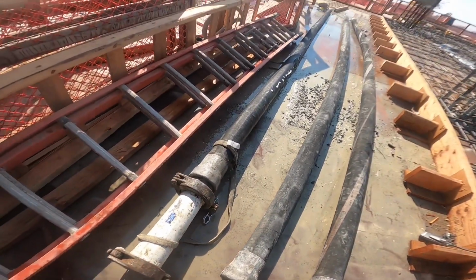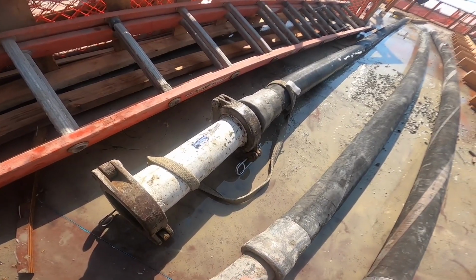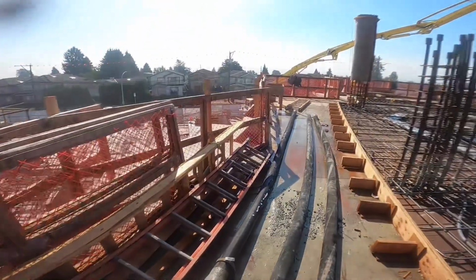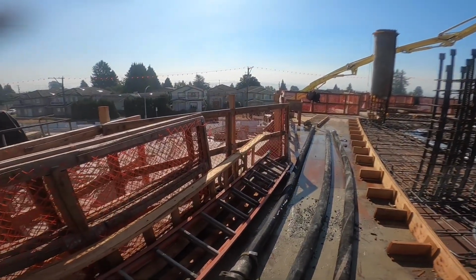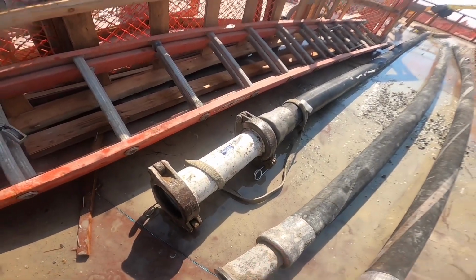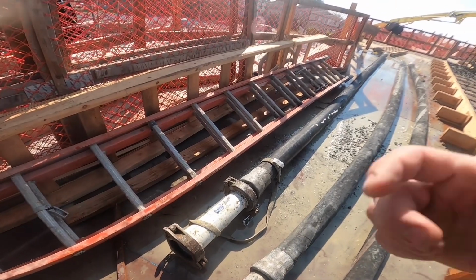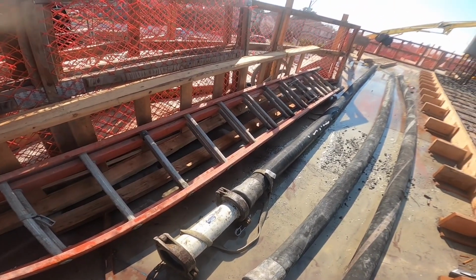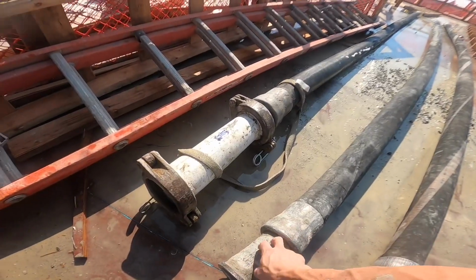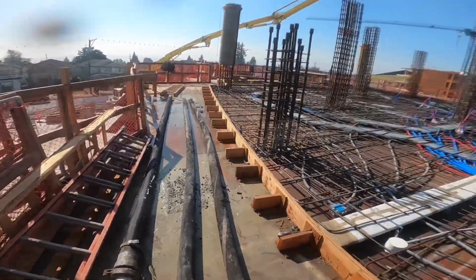The other crappy thing is if it plugs here and somebody smacks this with a hammer and puts a dent in it, this metal end doesn't last nearly as long. So we do have 5-inch to 4.5-inch reducing hoses where they reduce the stem. Not nearly concerned with those ones. It's a longer reduction and it's not nearly as drastic. Also, if it's the Alliance green line, I think the Conform hoses now too, they use a hardened end. This is not a hardened end, that's just regular steel. So anyhow, just one other thing I wanted to point out there.